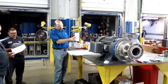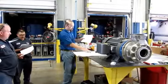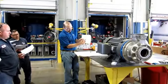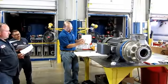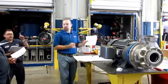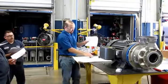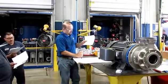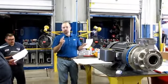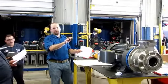Then we've got the impeller itself. The impeller rotates with the shaft; the shaft rotates because the motor's energized. Flow comes in the impeller on the suction side and out the other way — just like the Gravitron, it's centrifugal force. It wants to go to the largest diameter as that impeller spins. The impeller spins on the motor shaft and is driven by a key. There are actually two points of connection between the shaft and the impeller.